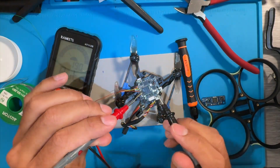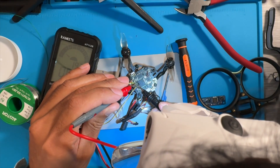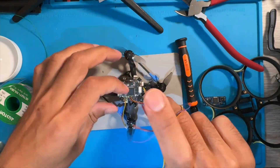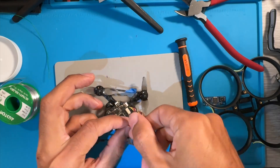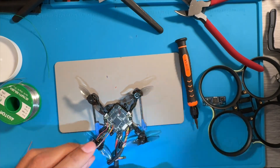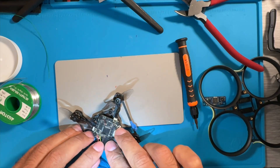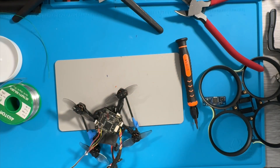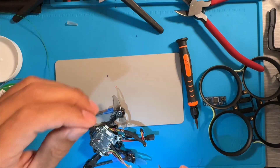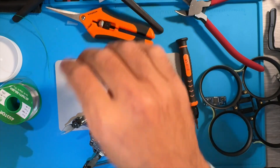So I'm going to test for continuity, and thankfully I got lucky — there was no continuity. None of my connections were bridged, which meant that if you put the battery in the thing wouldn't explode, which is what you want to confirm beforehand. Another way to test to see if your connections are bridged is to use a smoke stopper. I'm just applying black tape so that the connections stay more secure, and I'm putting some on the flight controller too. You just want to secure your connections — some gardening scissors from the garden, nothing special.